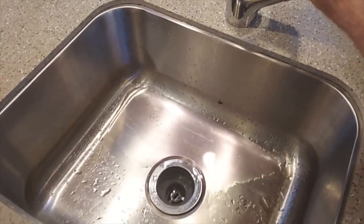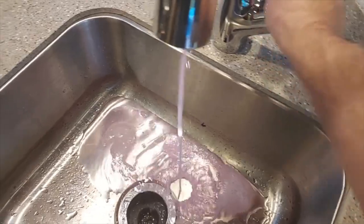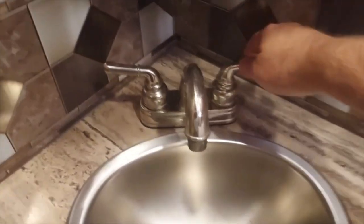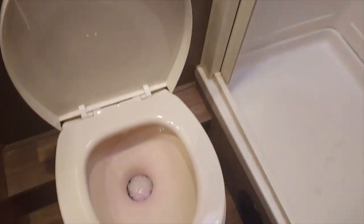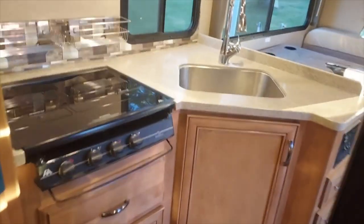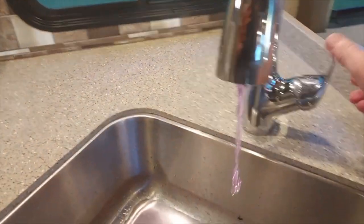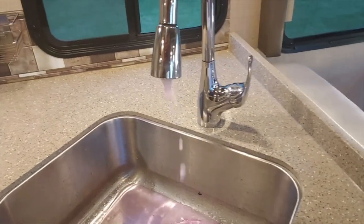Get back inside. You can do a little cold — see your pink. Do a little hot — see your pink. And I just go around like this till it's done. In the toilet, just flush it, get it going. You can hear our pump running and we're running out of water. So go around and open all your spigots, get the water out. And we'll wait for that pump to pull the tank as dry as we can.